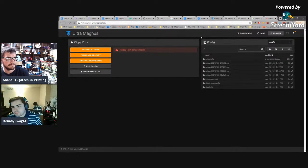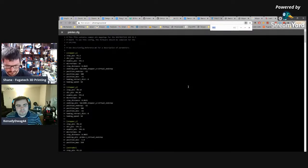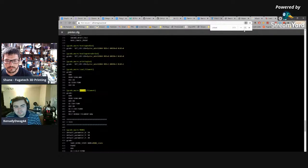So somebody on the Prusa owner's GitHub wrote a Python script to be able to use the temperature compensation in the Pinda v2. They unlocked the thermistor in Klipper so that you can do temperature compensation during bed mesh.